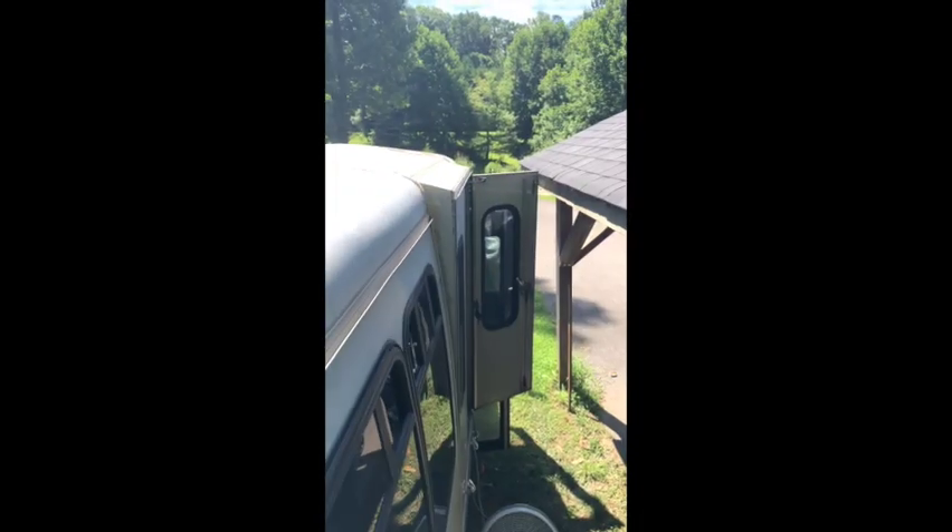There's a big crack right there and that's really what our problem is. I'm going to work on this seam here, starting from the worst part and working my way out. The front part that I did the other day is holding up quite well — it's really not leaking at all anymore. The lap sealant has really settled in and sealed itself.